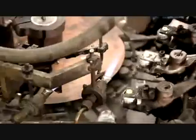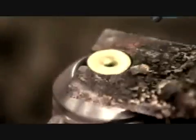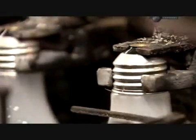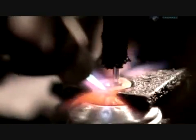The base is made of aluminium. This machine inserts one of the bulb's lead wires through the middle and solders it in place. It then spot welds the other wire to the side. The result? 2 base contacts to line up with 2 socket contacts.